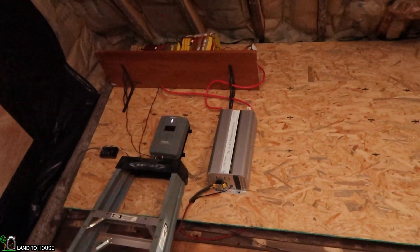So at 0.3 amps and around 27 volts, it ran all night and charged a little bit. Spencer Langston is going to be updating our turbine so that the stator is able to pull in more like 60 volts instead of this 20, and that will really improve our results here. We'll do that update once the stator has arrived. For now, this is going to conclude the video on how the electronics are run, and whenever we have better voltage down at the turbine, we'll come back and update you on the actual setup — showing how it is charging batteries and how things are running from rectifier to charge controller, inverter, all that good stuff.